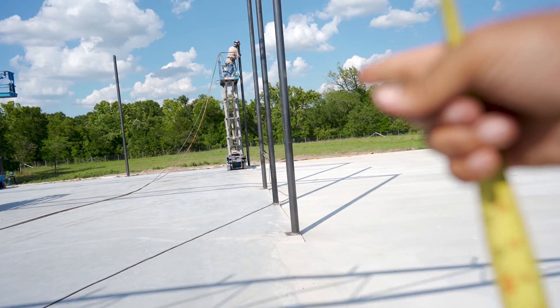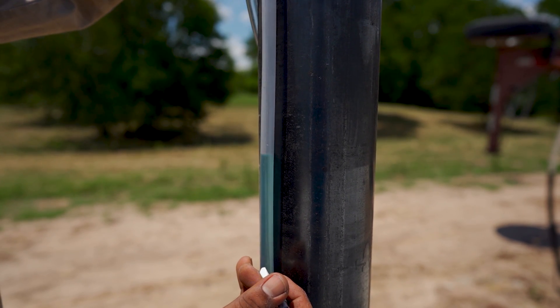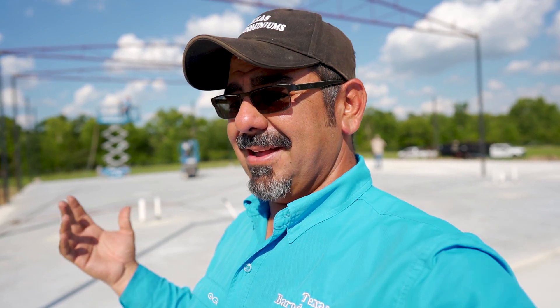Looks like they're all perfect except for one that's maybe off about an eighth of an inch. That says a lot for both the water level and the laser — one of them is off. If I had to put my money on one, it'd probably be the laser level, since it's faster to use, so it's probably faster to go around and get all your dimensions where the water level takes a little while to settle — maybe they didn't wait long enough and missed it by an eighth of an inch. That's pretty impressive when you consider the distance from that pipe to that pipe is about 60 feet — only off by an eighth of an inch over 60 feet.